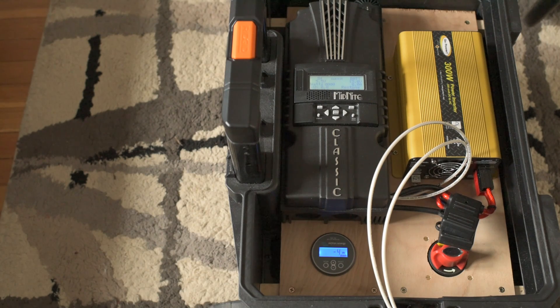You'll see it says something like 5.6 volts even when I'm not pedaling. I have no idea why it does that — that's like a resting voltage. There is no voltage coming through that wire to the charge controller right now, but it never says zero volts in. Maybe one of you that knows the why of that can explain it to me.